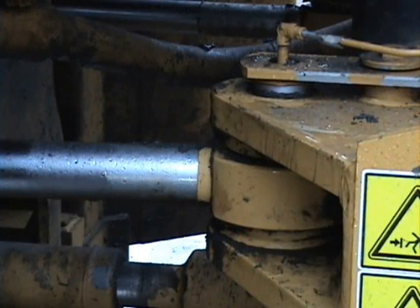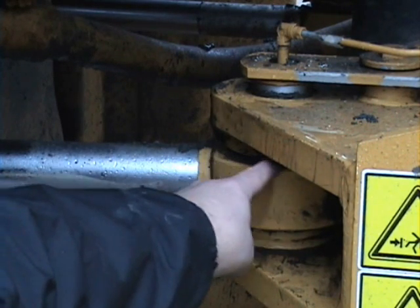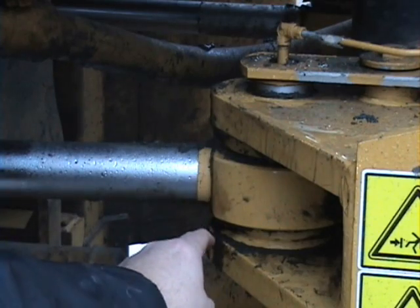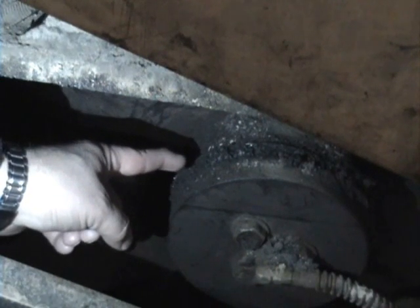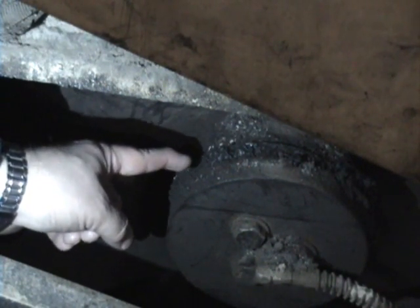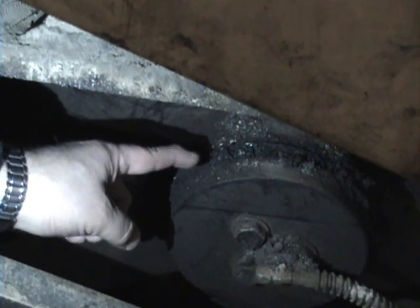Thanks Gabriel. As you can see, we brought in a wheel motor to show you what a properly lubricated bearing looks like. What we're looking for is a nice grease seal around the outer edges coming through the bearing in the pin to seal against contaminants getting inside the pin causing damage. As you can see on this bearing of a paver, the lubricant is coming out creating a wetness around the seal and the outside collar, not allowing the contamination and environment to come inside.